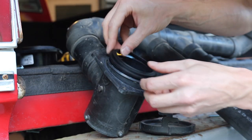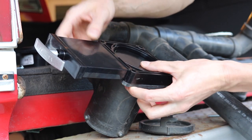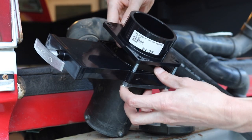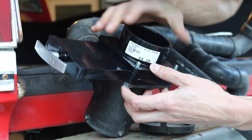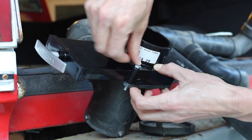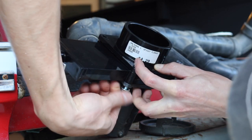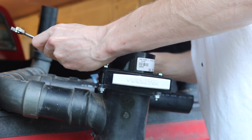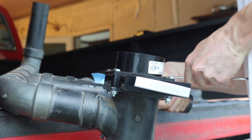Bolts in, putting the gasket back on, getting the valve on there, then a bolt to keep it lined up. All right, it looks good. We should probably put the bolts in the other way — if you need to access the nuts from the bottom it'll be way easier to deal with the nuts on the bottom rather than the bolt heads. Tightening crisscross like lug nuts so they tighten evenly.